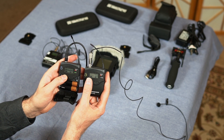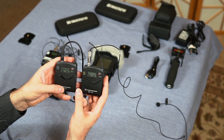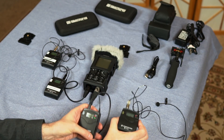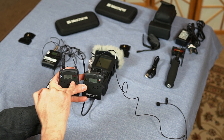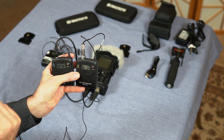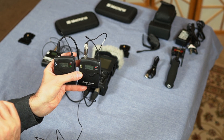If somebody's messing around with one of them they might accidentally change the frequency, so you can go into set and alter the frequency back so they're the same. Also be aware that if someone in the same vicinity is using the same frequency you'll have conflict. We can close the doors — these are ready to go. If the receiver is green, that means it's receiving from the transmitter. You can talk into the transmitter and see the monitor bar moving, and make sure you have a good signal before plugging into the field recorder.